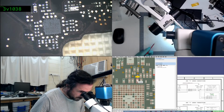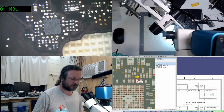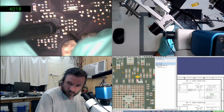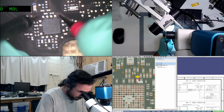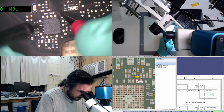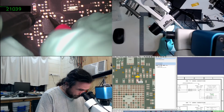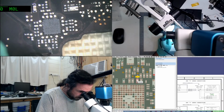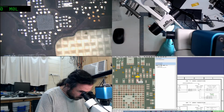Be a crack up if it actually was dead now. Because I could have sworn that this was working before. And then it stopped working. Okay. Okay, so 412, yeah, my multimeter's not the greatest, so that's within reason. And 20, so yeah, they're both okay. It could be a bad ISL, but not overly convinced of that. I mean, wouldn't hurt if I changed it, I suppose.